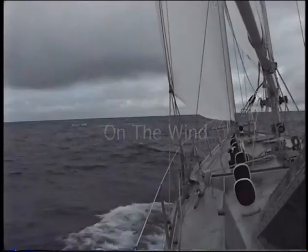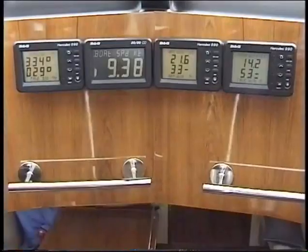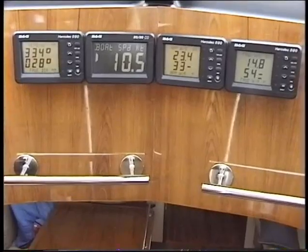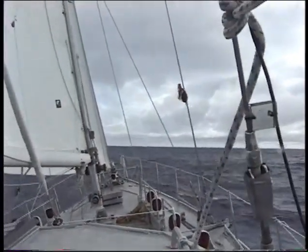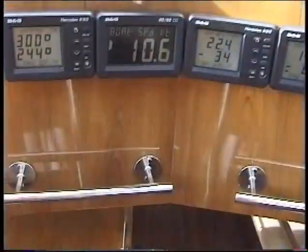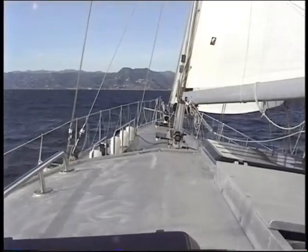Of course, not all sailing is off the wind. Occasionally, you have to go to windward. In these circumstances, at 30 to 32 degrees apparent, in 18 to 20 knots of wind, you can count on a reasonable level of comfort while making 230 to 250 miles a day towards your destination. Beowulf's long water line and fine bow entry, coupled with an efficient ketch rig, make this possible.